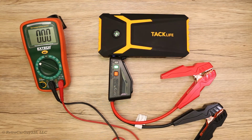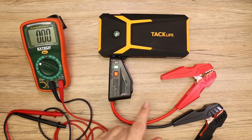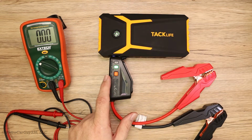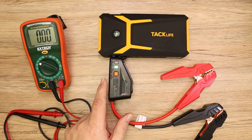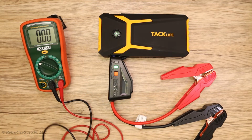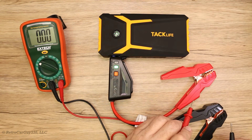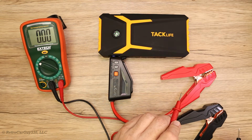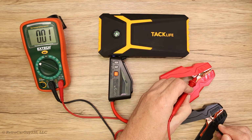And then after a period of inactivity, no draw of current here, it will actually detect that and then turn the relay off here to stop supplying power. Should hear it in a moment. And once it does that, we should get another test in here. See, it just turned off that light. You heard the relay click. And there's no power there again.